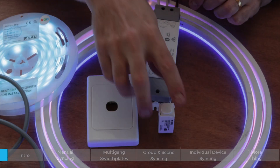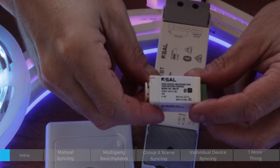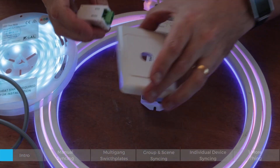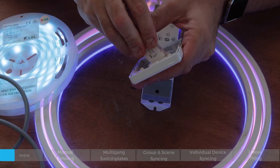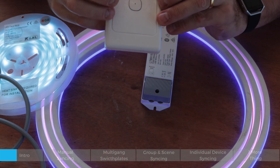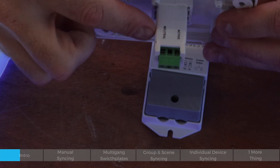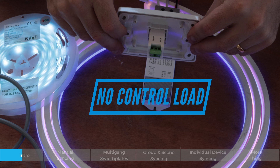In this video we're going to talk about the SAL Pixie digital multi-function push-button controller — this little guy here. You can see it's just a small mechanism on a standard plate, and it clicks right into the back of a standard 30mm aperture. It has a button on the front, and on the back all we connect to it is the active and the neutral.